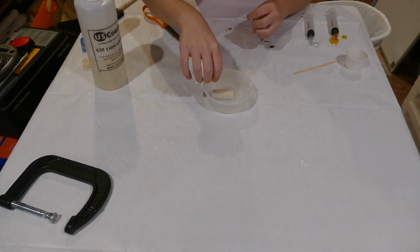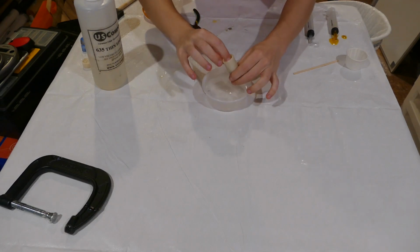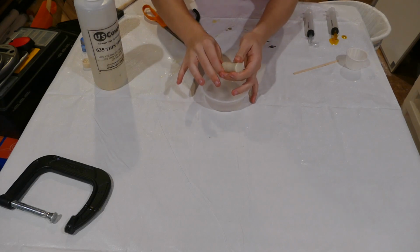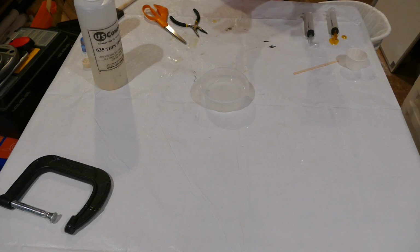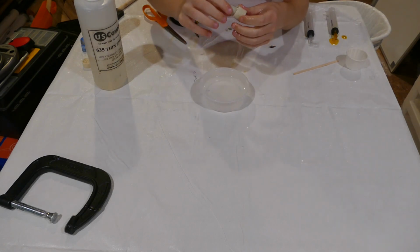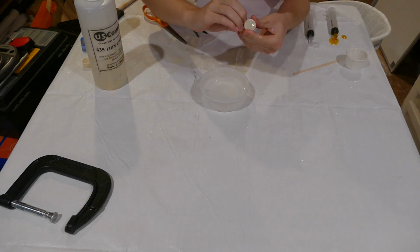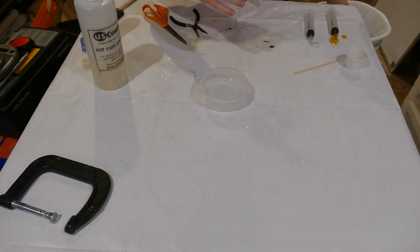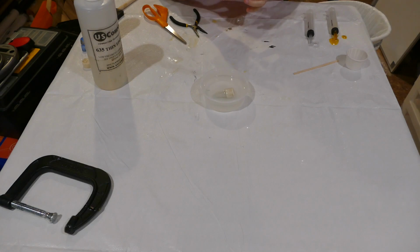All right, and now we can go back to our compression molded tip here. It's only been a few minutes and you can see already that, yep, it's just completely falling apart. This is a rather messy process, as is all of this stuff with composites. But it's hard to argue with the results. Set that back in the acetone for a few minutes just to get any bit more stuff dissolved.